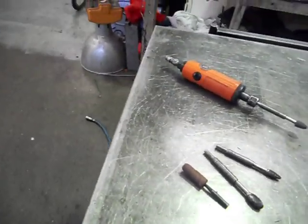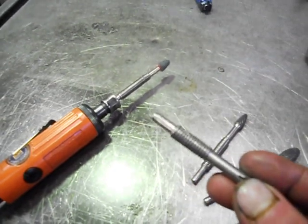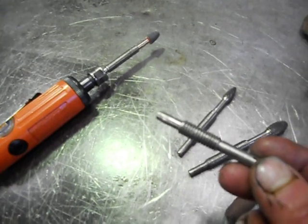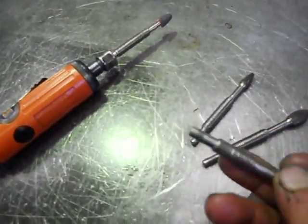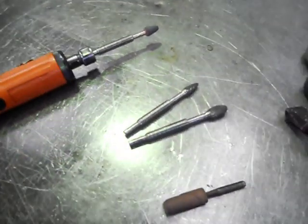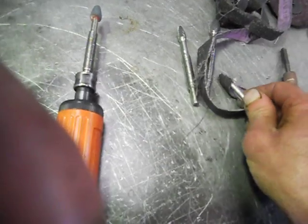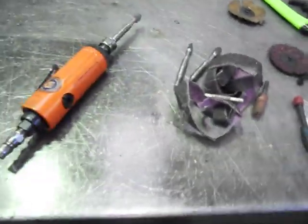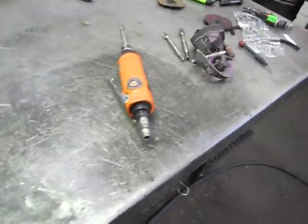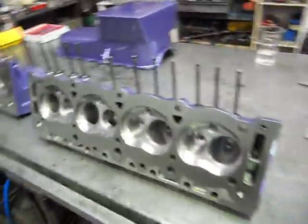For polishing I've tried everything - polishing is just a pain. I go primitive mate - the cheapest and best I've found is the same 3/8 stainless steel bar turned down to a quarter-inch for the chuck. I cut a slot down there with a hacksaw and then get some emery tape, wrap it around the shaft and it acts as your own big flat wheel. It gives you a better finish, covers a lot more area and it's smoother. It does make a hell of a mess - you want to wear a face mask as you're breathing all sorts of dust and abrasives.